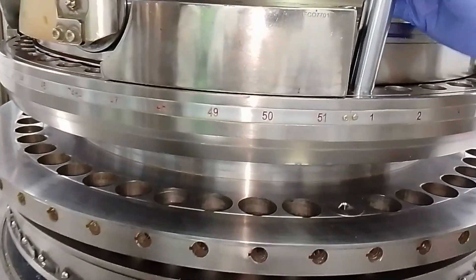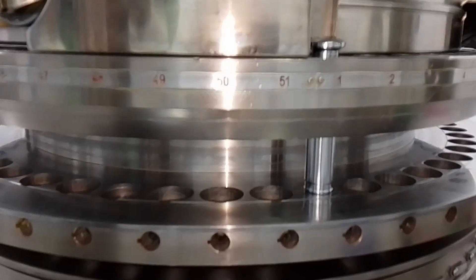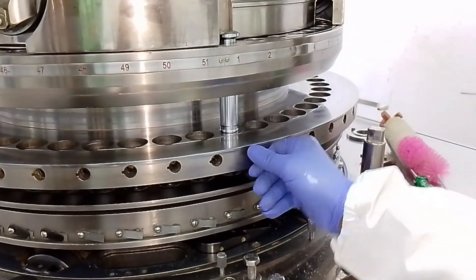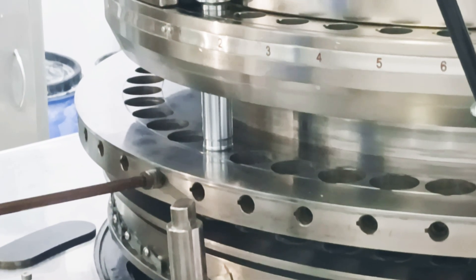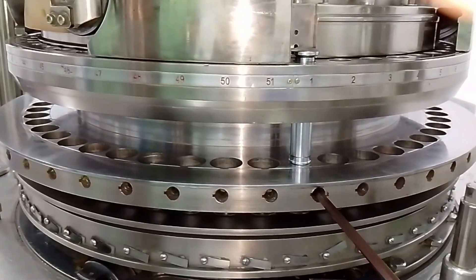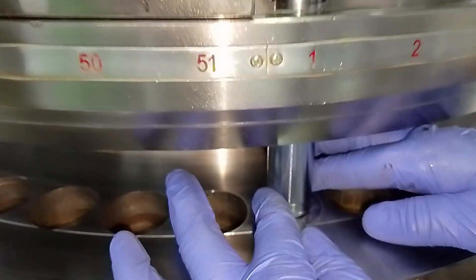After applying grease, this punch has to be set properly. Finally, check the sound between the upper punch and the die to see if there is any sound coming between them. We have installed the die. After this, the lock of the die has to be taken — my locks are already installed in the machine, so I will just tighten the lock with the T-wrench so that the die does not move and is set properly. I have set the die.